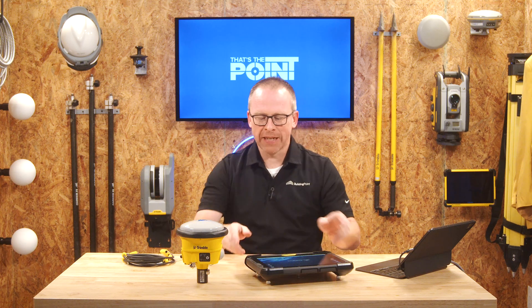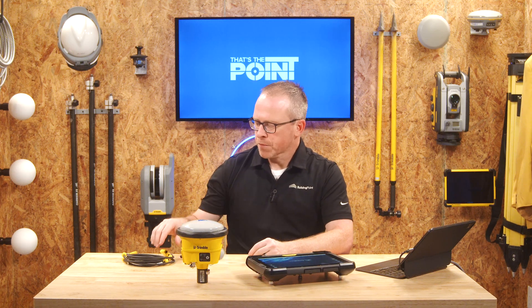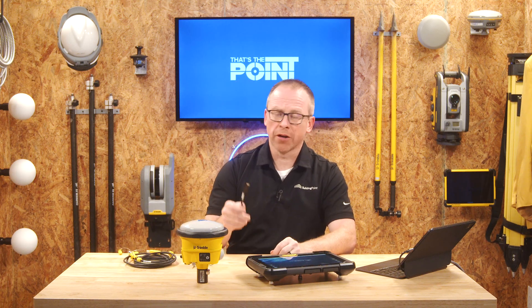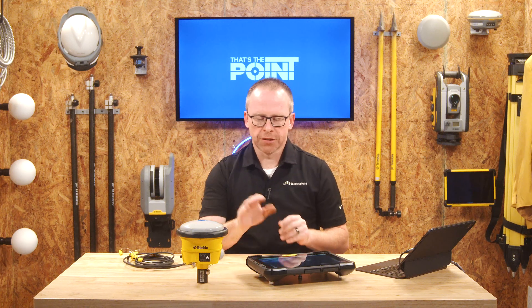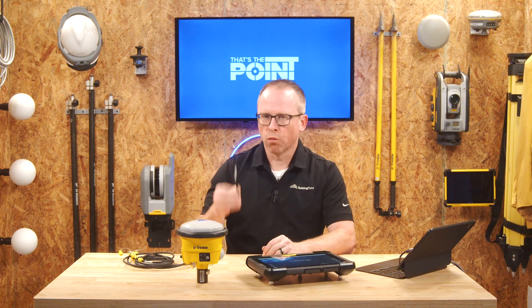The other things we're going to need: obviously we need a receiver — that's the first thing we need to update the firmware. You're also going to need a PC. We're going to use a T100 just for simplicity, but you can do this with any PC that has Trimble Installation Manager installed. We're also going to need the included USB to LEMO cable that came with your GNSS receiver. And in the case of the T100 or a brand new laptop, you will also need a USB-C to USB-A adapter, because this LEMO to USB cable is still USB-A. The Trimble one that's included works, but really any USB adapter will work in this case.